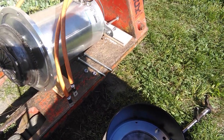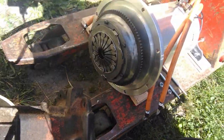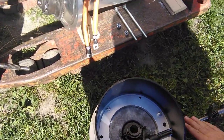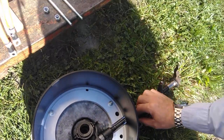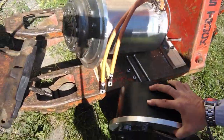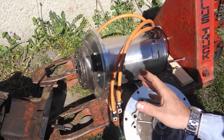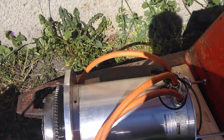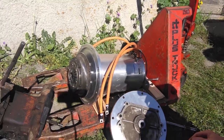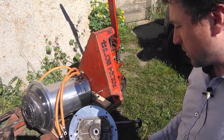It would probably be easy to construct for somebody with a technical engineering background, but I'm not from an engineering background, so it took quite a while for me to come up with a good solution. I had to cut it out here in order to accommodate the arm, and I had to drill all the holes here in order to attach the cover on this side for the gearbox. I had to calculate all the right distances so that the motor and gearbox would still fit into the car. On the back there's also a custom-made mounting bracket for the motor, and we will see in the next video how we integrate the whole motor and gearbox assembly into the car.